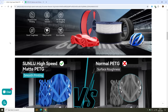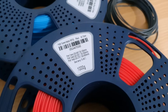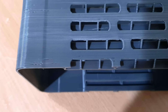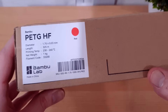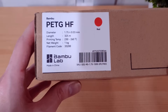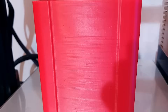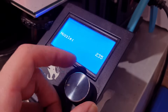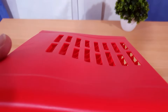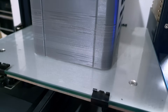I've been looking at the latest PETG variations from Sunlu and Bambu Lab. I tried the Sunlu high-speed matte PETG first, but it printed terribly with loads of problems, so I complained to the seller and got a refund. I then tried the Bambu version called PETG HF — it sounds perfect from the website's description, though it warns you need to dry it before printing. I did this, but it still printed terribly. I dropped the temperature close to its melting point and the result was a very warpy print.